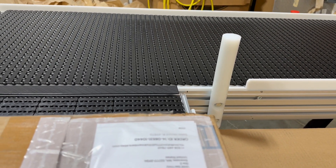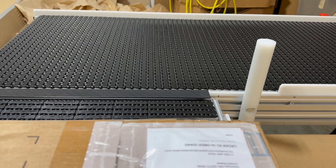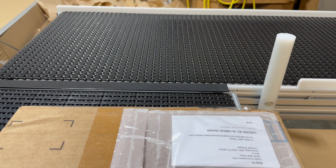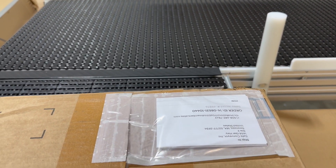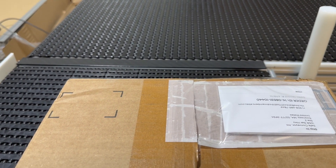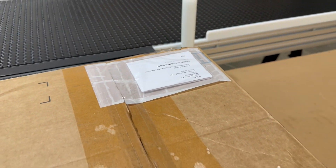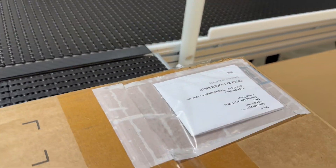This is a great setup if you have a long package and you're thinking you need a three-foot conveyor to make it turn. Not necessarily — the width is probably more important than anything else. You can turn a 24-by-36-inch package on a 24-inch wide conveyor simply by having it transition the corner and go downstream a little bit.